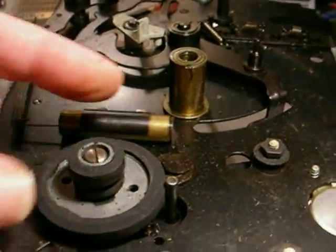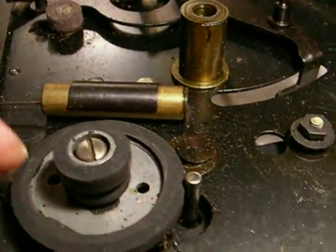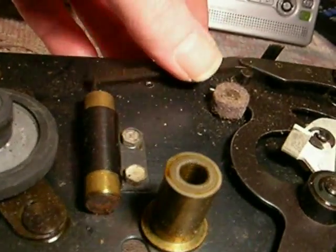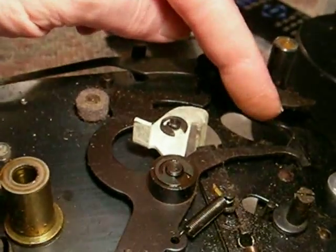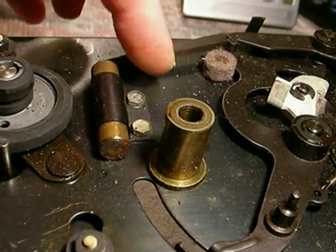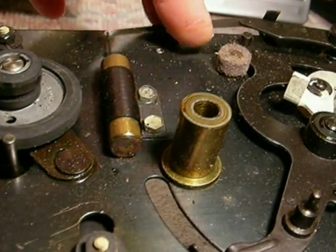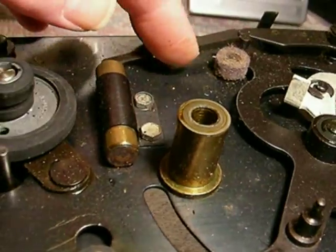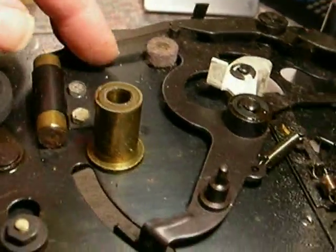This also uses the same drive wheel — it's the first edition, with two holes and a silver/gray color. This one is stuck and can't move at all and has to be replaced because it has a severe dent in it. It also has the dash pot right here — what I call the piston — which guides the tonearm post down smoothly. This has to be very clean but with no oil. If you put oil in it, it'll seal and the arm will just stay up in the air forever and won't settle down on the record. That's the first edition of the piston.